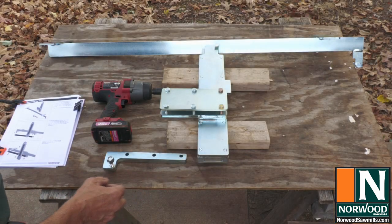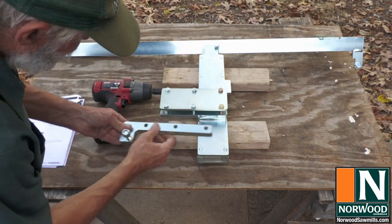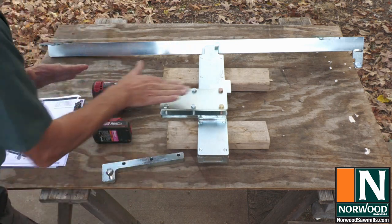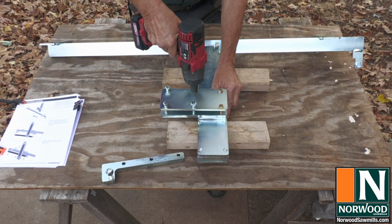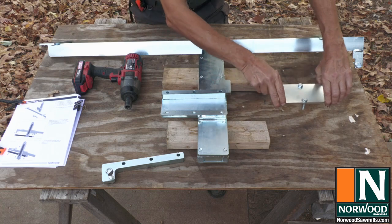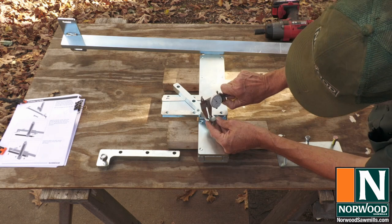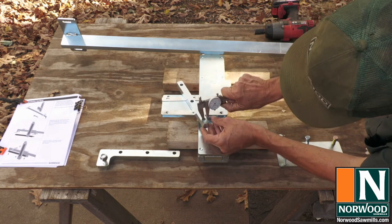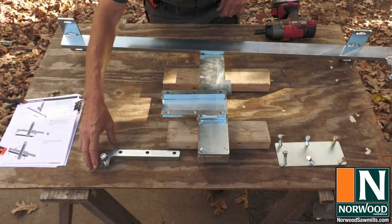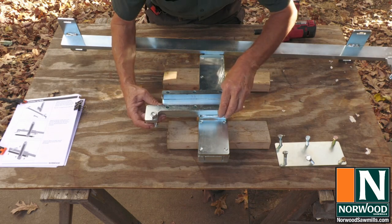The clamp has to slide both side to side and up and down. It comes partly assembled, but you'll need to take the top plate off and install the sliding cylinder attach arm and the cross slide. Again, when you reassemble the bracket, make sure that the spacer is turned to give as much inside clearance as possible. Make sure you remember the shims. There should be one on each side. The cylinder attach arm, though, can only go on one way.